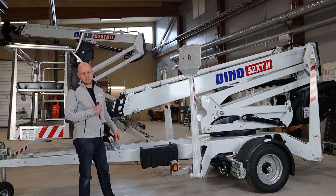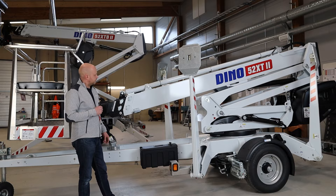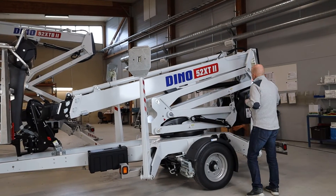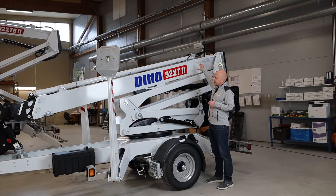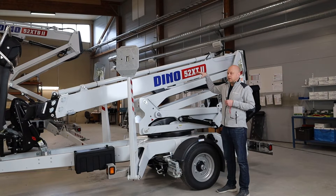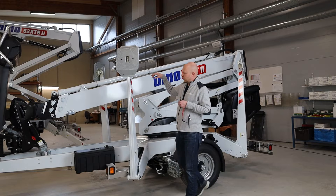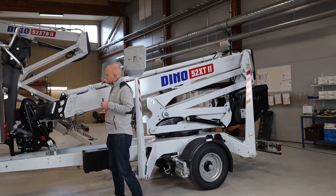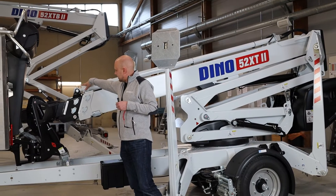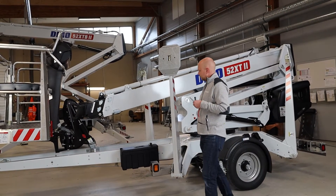The cat tracks for electrics and hydraulics are mounted inside the boom to protect them and reduce the possibility of damage, avoiding potential downtime. At the back of the extension cylinder there's a damping mechanism — when the boom is extended towards the maximum horizontal position, it creates a bending moment for the extension cylinder. The damper at the back creates two support points and reduces wear on the seals and o-rings at the front of the cylinder, extending its lifetime and reducing maintenance.